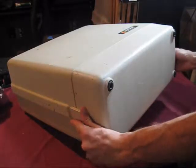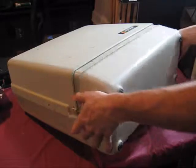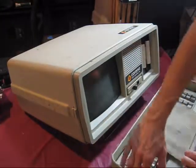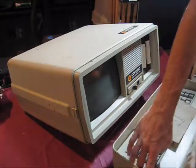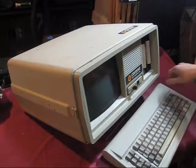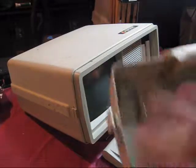The front panel has two clasps to reveal the screen and floppy drives. The lid holds your keyboard and cables inside a velcro strap. The original keyboard cable would have been a stretchy spiral type, but it went missing and I had to secure this replacement from Fry's. It's a 6-conductor RJ11 — most phone cords are 2-4 conductors, so you'll have to seek out the 6-conductor specifically.